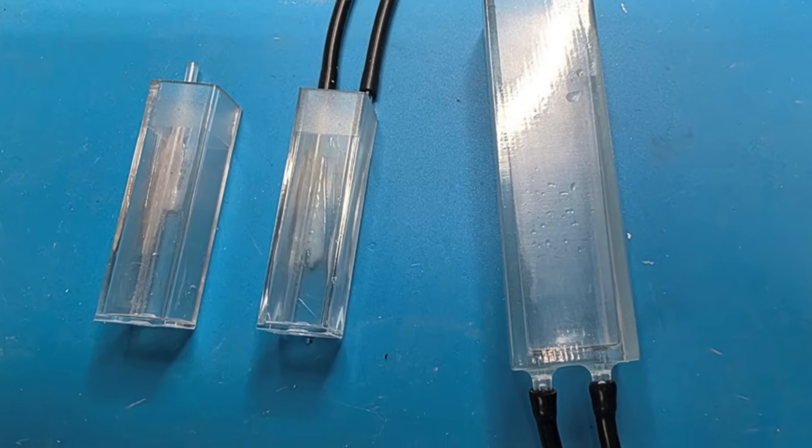We also put drains in the bottom. Before, we were having to suck the water out of the cuvette from the top. Now we open a valve and the water drains by gravity. The bottom of the cuvette is also tapered down so it's conducive to draining. When you're talking about such a small sample size, even a little bit of reagent left inside that tiny cuvette could potentially impact the next test. We had to get it all out, and the best way was opening a drain on the bottom — gravity pulls it out, with no chance of cross-contamination.